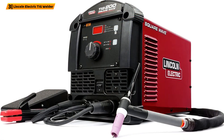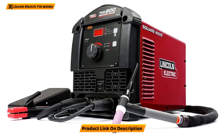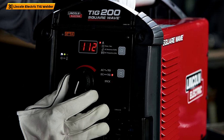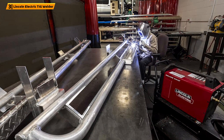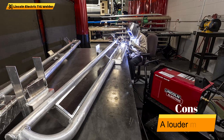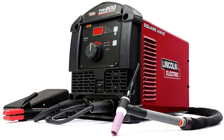Input power: The AC-DC TIG welder is dual voltage with 120V and 240V options. Depending on material density and thickness, you should adjust accordingly for a precise and smooth weld. Duty cycle: The 120V phase supports a 25% duty cycle for TIG and 20% for stick at 125A and 75A respectively. For the same duty cycle, adjust amperage to 200A and 170A for TIG and stick uses. Weight and size: This machine weighs 46.5 pounds and measures 20 by 20 by 13 inches — lightweight and easily portable for a range of tasks.